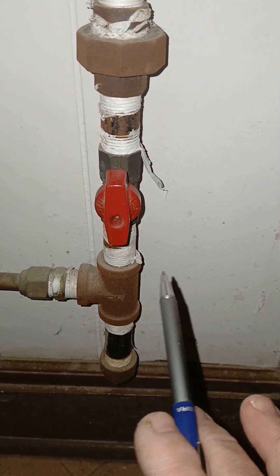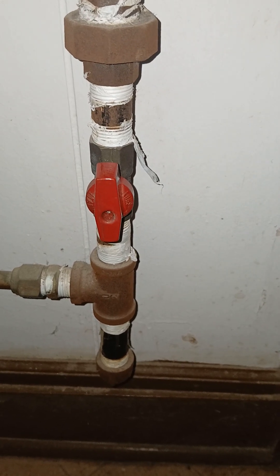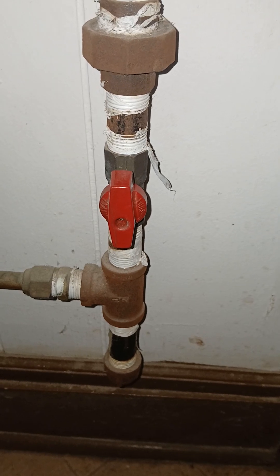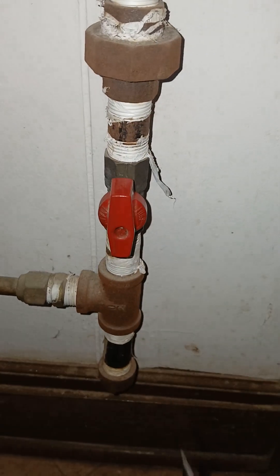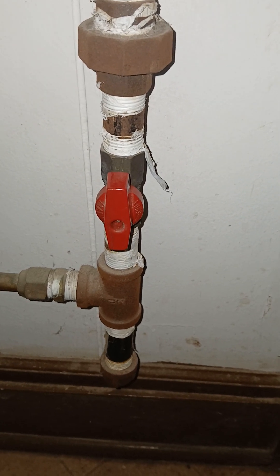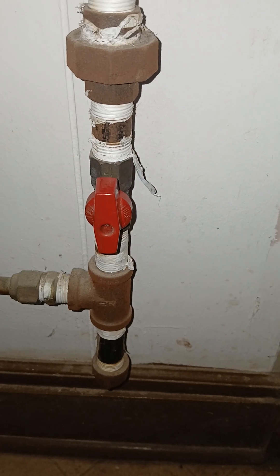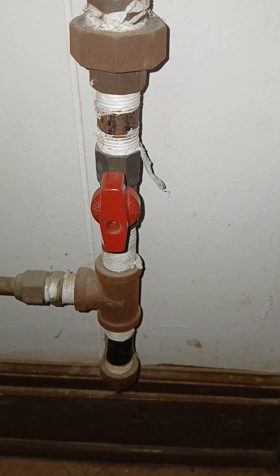You can do all of this without having to come back and break things down further up the line. So again: the cutoff goes before the union — that's the correct order. Cut it off, break the union, change the unit, work on whatever needs to be done, then turn the unit back on. Cutoff first, union second, then your unit. Thanks for watching and have a great day.